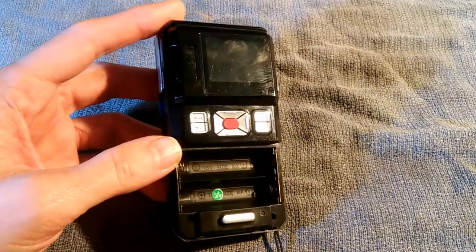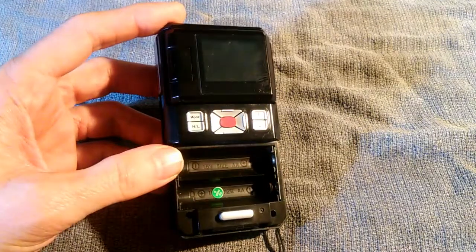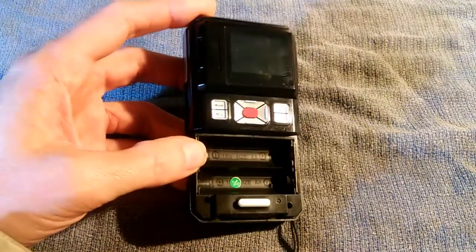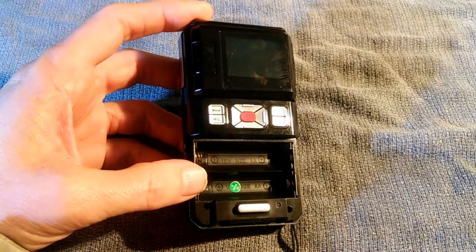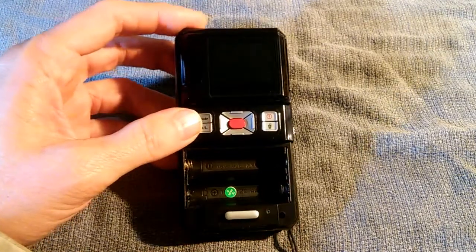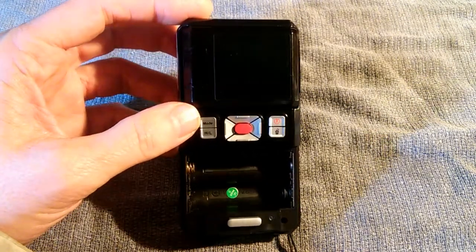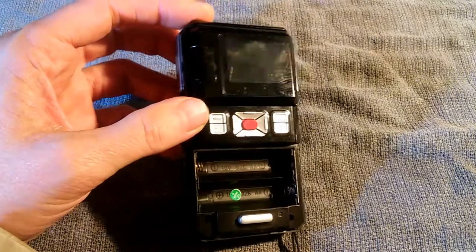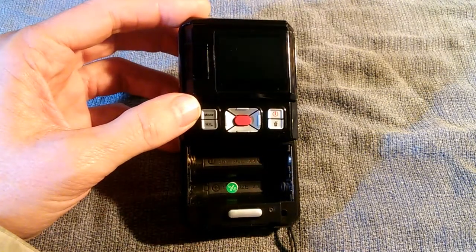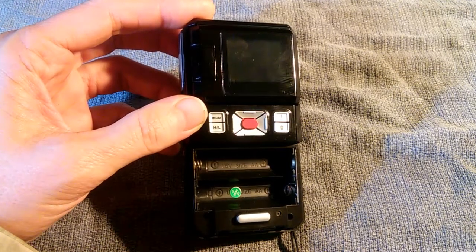Just a word about batteries and battery leakage. Really be careful about leaving batteries in consumer electronics that you're not going to be using for a while — battery leakage causes an awful lot of damage. It has been my experience that so-called heavy duty batteries, also known as zinc chloride batteries, cause a lot more damage than alkaline batteries. The zinc chloride is a powerful acid and it really does a lot of damage. The alkaline batteries leak potassium hydroxide, which is a strong base — it's just not nearly as corrosive, at least in my experience. So number one, don't leave batteries in things for years without checking them. Number two, if you're going to use non-rechargeables, use alkalines — don't use heavy duty batteries.